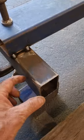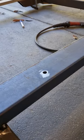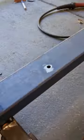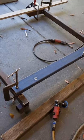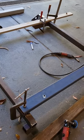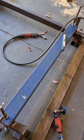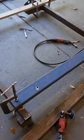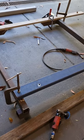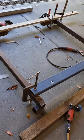So this is where the rear rubber mounts go. This here picks up through the cab, and underneath, if you can see that, underneath I have put a larger hole there so I can put a socket up there, tighten a nut and so on, so a bolt will drop down from the cab through the mounting point on the cab into this brace. I'll probably eventually weld a nut, so capture a nut underneath, just to bolt the bolt straight into.